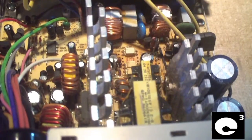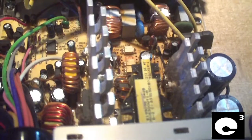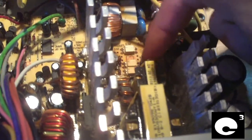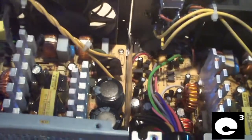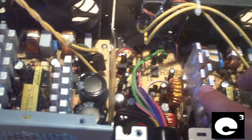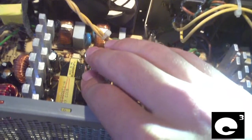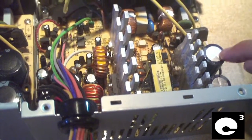Let's pan out and have a look at both power supplies. Here's a better look at the 250-12E — notice the burn marks on the board in this area. Comparing both side by side, you'll notice right away that the heat sinks on the 250-12E model are actually thinner than those on the 12Z.